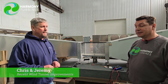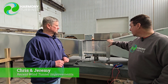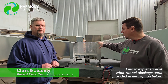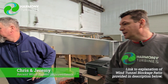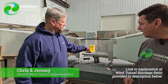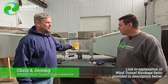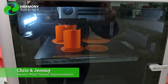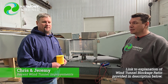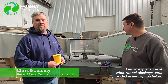Just today Jeremy and I were chatting about our blockage and the articles indicating we want to be below 10 percent. We're right at about 10 percent with these models — they're small, but compared to this testing area they're not that small. That's about a perfect 10 percent blockage. But we are now printing a few at seven and a half percent blockage, which puts us safely under that 10 percent figure without being ridiculously small.